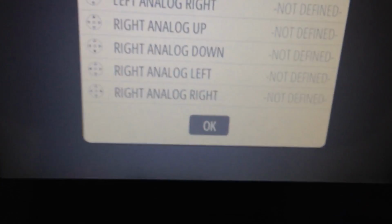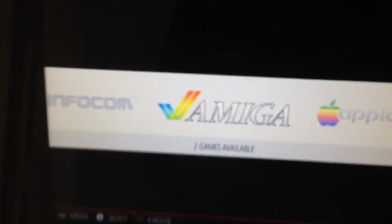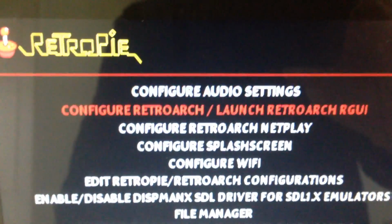There. Then it goes to the OK button, and to do that you then press A, which I've mapped to this button here, which is a Z, but that's what Emulation Station sees as A, so I'll tap that and it should let me in. There we go, so it's gone with the default theme of carbon. I changed mine on that earlier one back to simple, but yeah, this is carbon, and it's got the default emulators there. Joystick's quite happily scrolling through. And I could choose options. So what you probably want to do actually is choose the RetroPie option, hit your A button to get in that menu. Oh. And you could hear, what we've got?